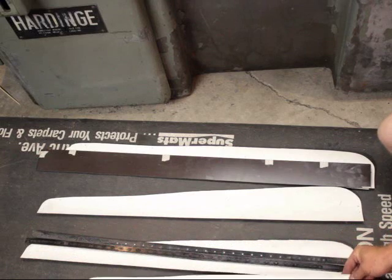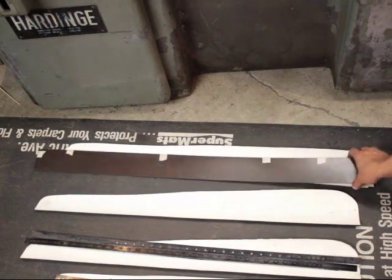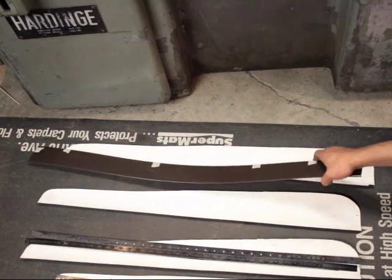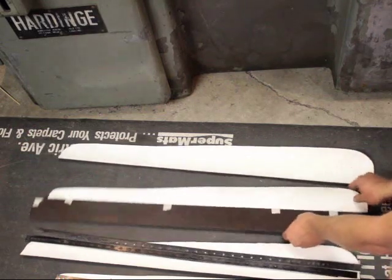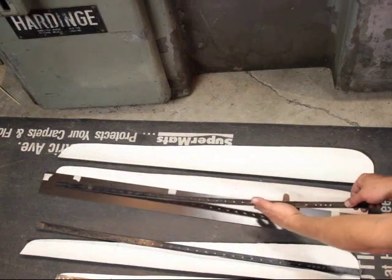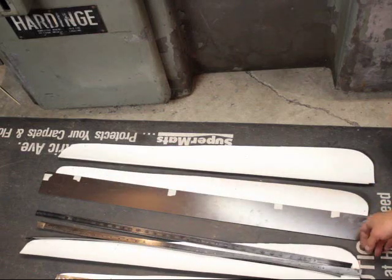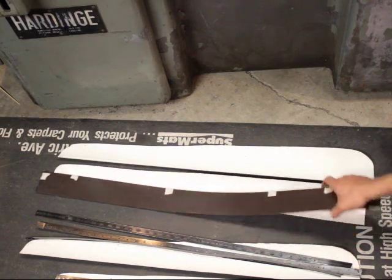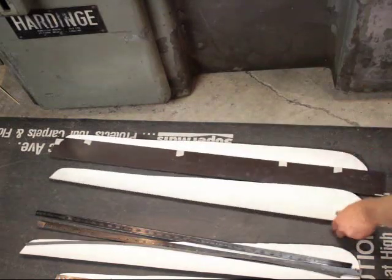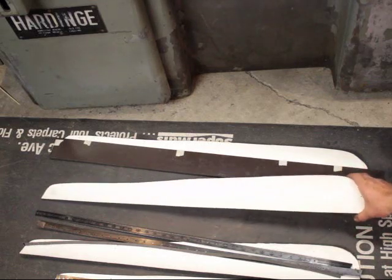This is my own idea and I've put up a video on how it's done. I know folks dislike PVC, however this is very different from just running a straight PVC blade — because obviously bare PVC is a wet noodle and would fly to pieces in the wind. Once you add two pieces of steel, pop rivets, and a piece of three-quarter inch pallet band, you can just imagine the tensile strength. You're not going to break that steel. There is a possibility you could crack the blade, but these are very inexpensive to make once you have the jigs, and they're very effective. It's all about low-end torque and durability. I may eventually make them out of wood or something else, but right now PVC gives me the shape at an economical price, and that's what I'm going to run with this one.